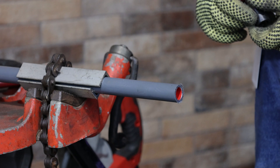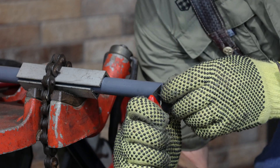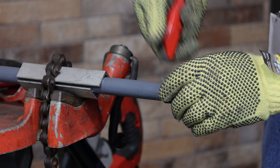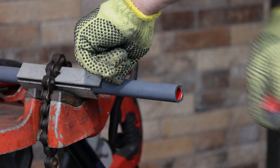The thread protector attached to one end of the conduit can be used to gauge the length of the cuts. Push the thread protector over the cut end of the conduit to be threaded. With a knife, cut around the circumference of the conduit through the PVC coating to the metal. This cut will indicate the starting point for the longitudinal cuts and will give an even ending to the PVC coating removed during threading.